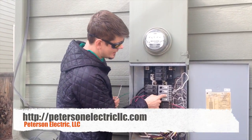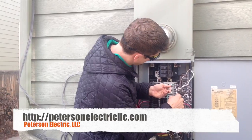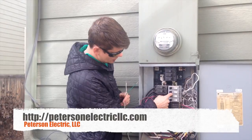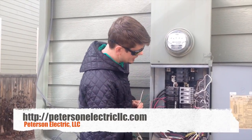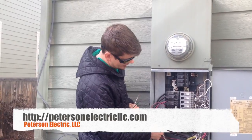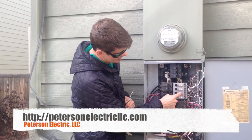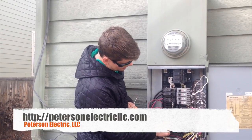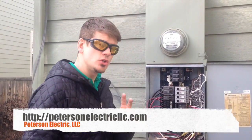It is still blown — I can see that. I know it's hot. When I had the video off, I actually took circuit 8 and moved it up again so I could get these to blow. I put in their old breaker because I don't want to blow out my new breaker — it can only tolerate that so much when 240 is hitting head on. So we went here to test it and here to test it. This is tripping normally, but I still can't get the old original one to trip. As soon as I put it on — boom. So now I'm wondering if I have a ground or a neutral fault.